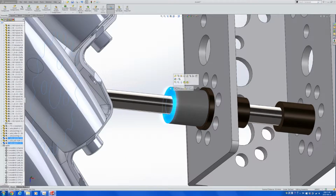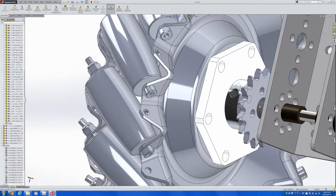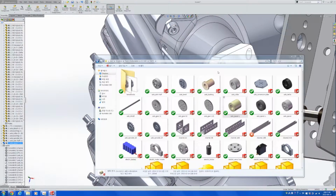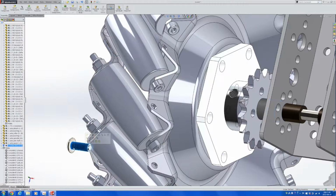And as we do, something might be crossing your mind. In order to keep the sprocket in that place, it needs to be secured with a bolt. But then the bolt might actually coincide with the nylon spacers. And since we're trying to check if an assembly is possible or not in this case, it's actually beneficial to finish up an assembly complete with bolts and nuts and everything.